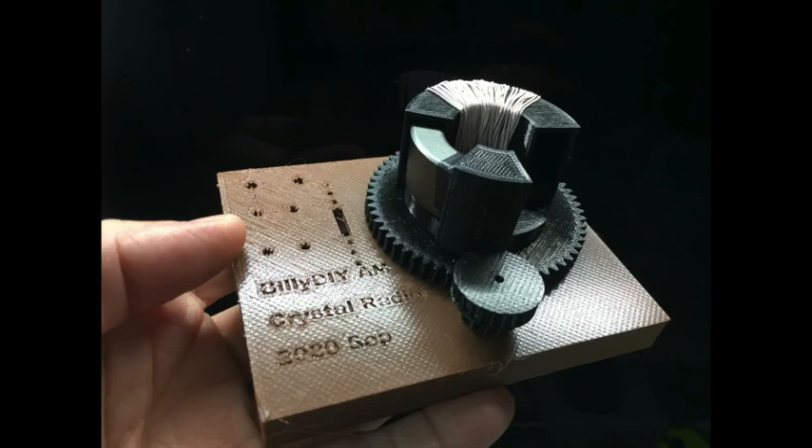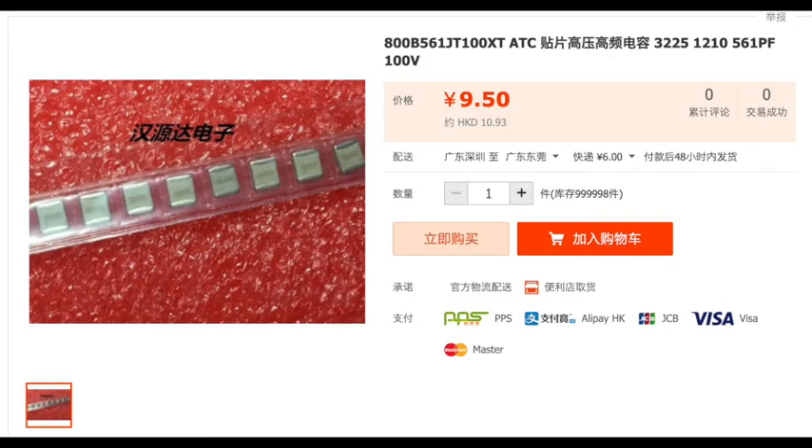First let's test the ferrite ring one. To do the test we need to pair it up with a very high Q-factor fixed capacitor. I got this type of surface-mounted device SMD fixed capacitor with a Q-factor of more than 10,000. This one is 560 pF. I'll share the link in my YouTube description where you can find it on eBay. If you click through those links you won't get a price change, but it will help support my work — so thanks a lot.